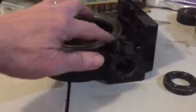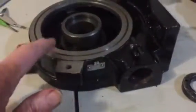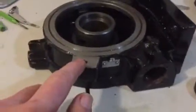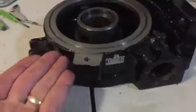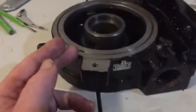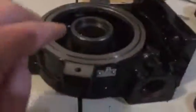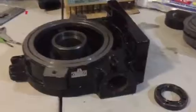It takes quite a bit, and it's oiled very well. The oil passages come in from the top right there and follow those passages around, plus this single passage right here. Between those problems, I'm not exactly sure what to do. I was wondering if anybody has ever rebuilt one of these — maybe put different bearing sets in there. I really think I'm going to have to shim that to bring that plate up, because I believe it's just too tight when I tighten it down. It sucks it in so hard against this metal-on-metal plate, even though there's lubrication there. Curious about your thoughts.